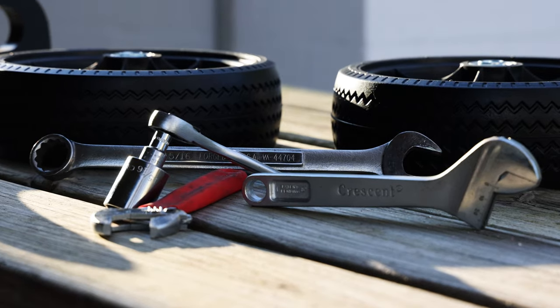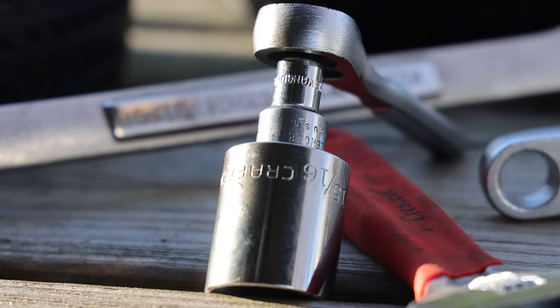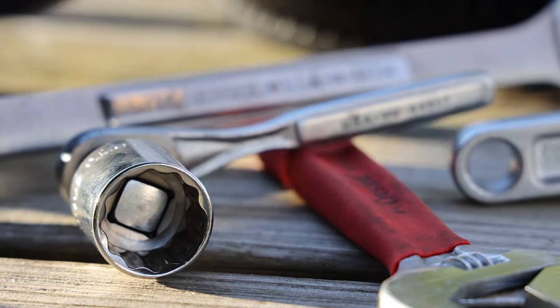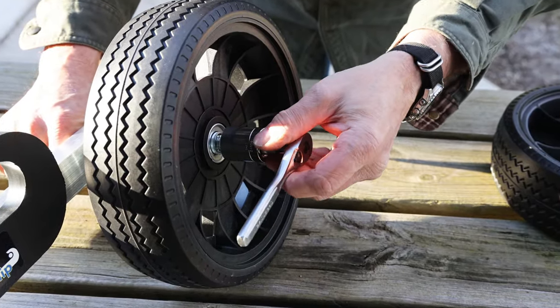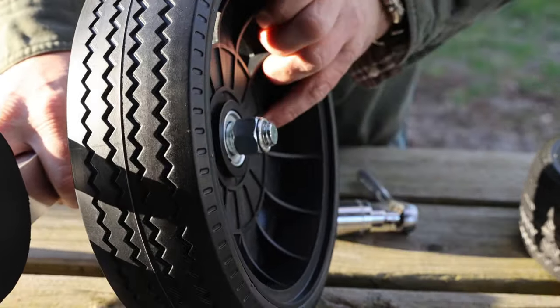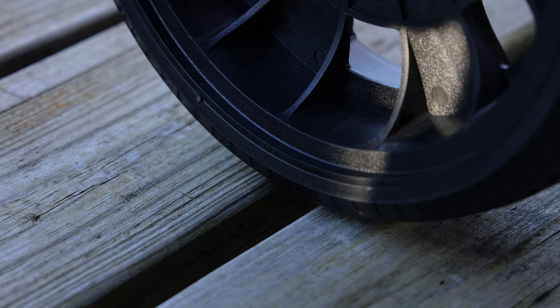There's a chassis with a canvas bag nestled inside holding two wheels that need to be installed. There's a multitude of tools you can use to put these wheels on — I don't like to play favorites so we drew straws. The quarter inch drive ratchet stepped up to a half inch drive 15/16th socket might be a little ridiculous, but the point is you don't need to apply 2 million foot-pounds to the axle nuts. These nuts just need to be snugged to the point where there's no side-to-side movement — overtightening can damage the wheel bearings. Repeat on the passenger side.